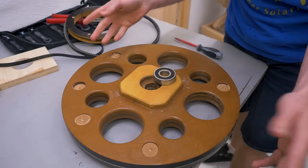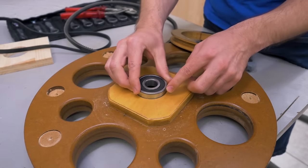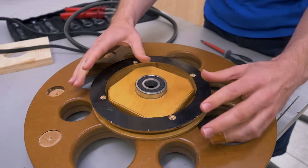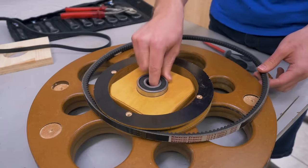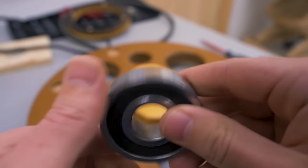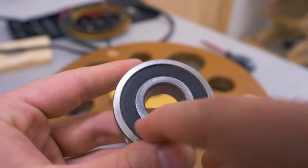While I'm waiting for the new bearing I can't really continue with the rest, but I'm really curious about why and how this bearing failed. I have two theories. The first is that it was a mechanical failure because this was the side where the pulley was attached, meaning this bearing had to take the load from the bandsaw blade tension, plus the tension from the belt, plus the torque from the motor. My second thought is that it was a failure of the rubber seals — if they fail, dust accumulates inside and mixes with the grease, and that gets worse over time. Or it's a combination of both. So let's open it.